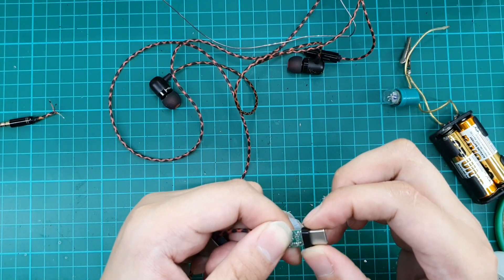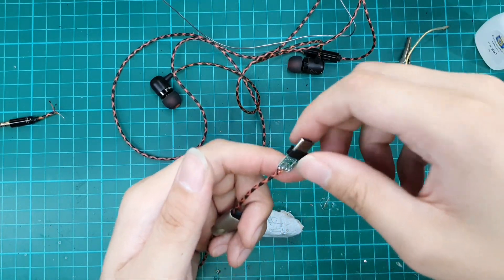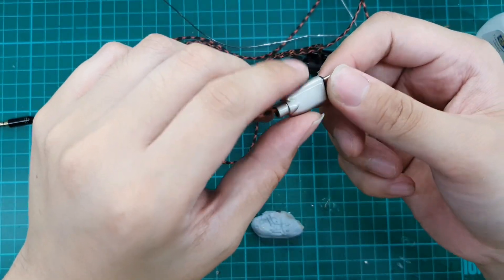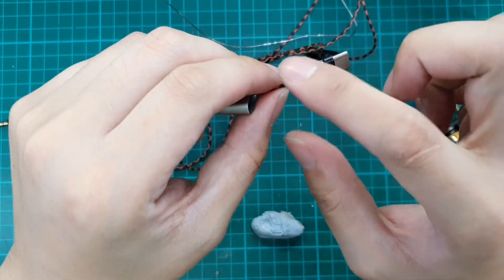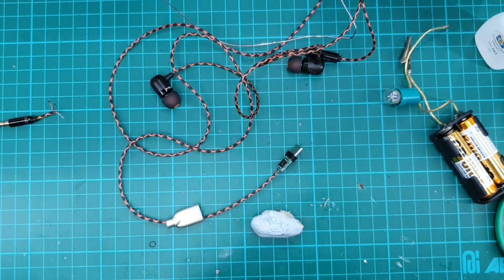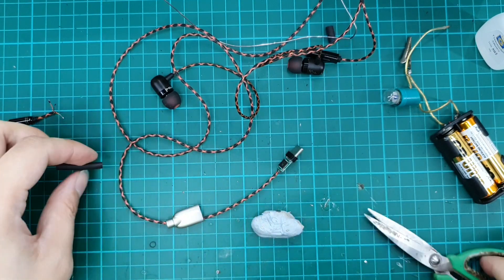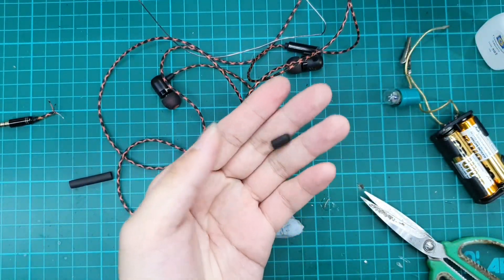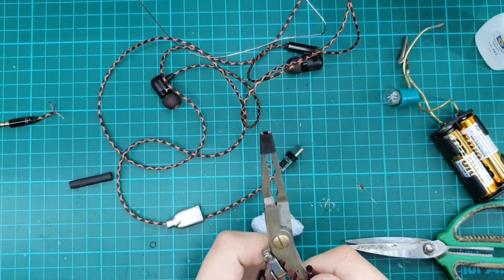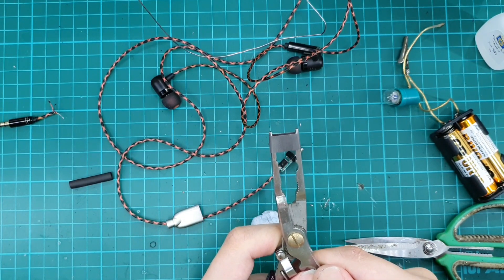I have it done — they're already stuck. You can finish the job like this, but it will be better to put some strain relief here. We'll be cutting some heat shrink — I forgot to put it in beforehand, so please remember to do that. If we didn't install the heat shrink before and it's too small to fit through now, we try to expand it. If it doesn't fit, we'll get a bigger size heat shrink and do the same.